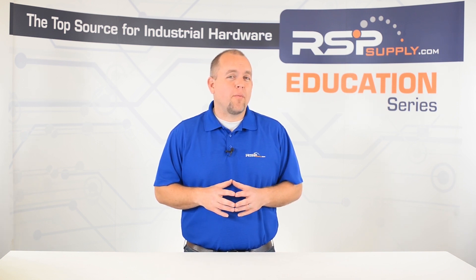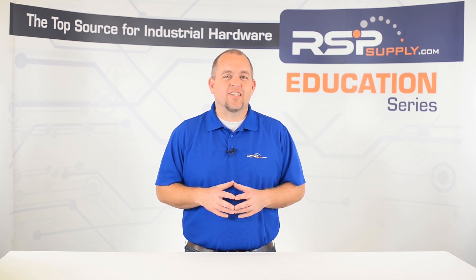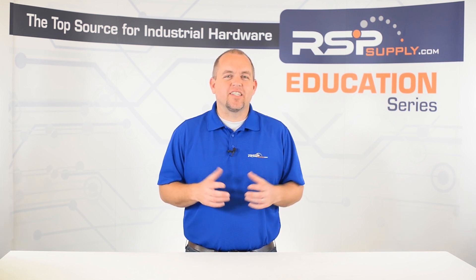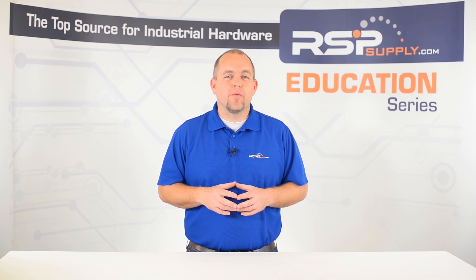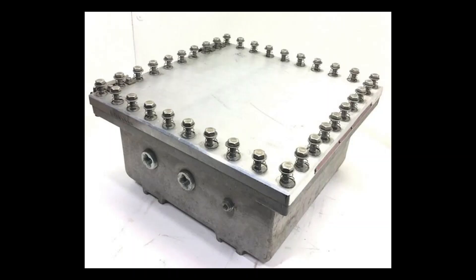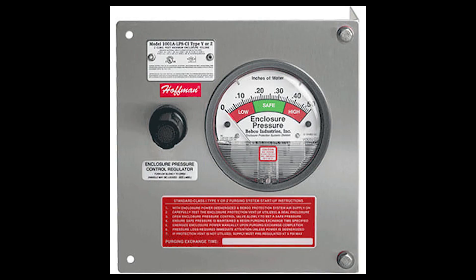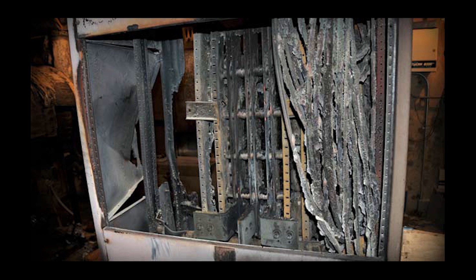In one of the most common applications, you will find electrical equipment installed in hazardous areas that can increase the risk for an explosion. In order to meet safety standards in these scenarios, you must install the equipment in an explosion proof enclosure, which can be very expensive, or you can use a purge system. In this case, the purge system uses incoming air from a supply line, and with the assistance of solenoid valves, pressure gauges, and pumps, the purge system will constantly maintain a positive pressure inside the enclosure housing the electrical components. Therefore, it will not allow any potentially flammable gases to enter the enclosure, which could cause an ignition event to occur.